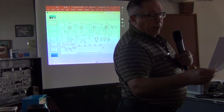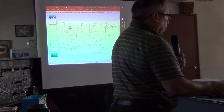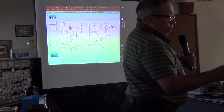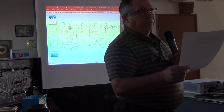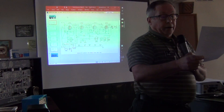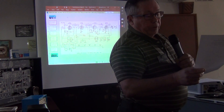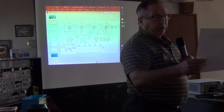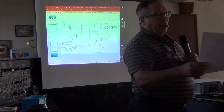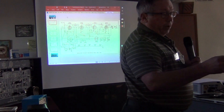The RF and oscillator transformers use variable capacitors with fixed inductance. The broadcast band for our example radio is 540 to 1650 kilocycles. The oscillator runs 455 kilocycles above that, so it ranges from 995 to 2105 kilocycles. Alignment tracking is done by a trimmer capacitor on the oscillator section of the variable capacitor — you do that at 1650 and peak the antenna section trimmer at 1500.